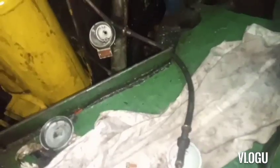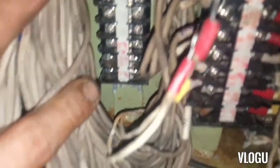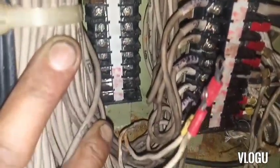The new PT100 is still connected. I follow the wire going to this junction box, and based on the manual the numbering here is from the temperature sensor to this junction box. Now I think I found the problem - this terminal block I tested has a ground fault, and if you look closely we have some moisture. That's why I think the PT100 temperature sensor gives a wrong reading or error in the monitoring system.